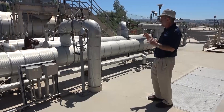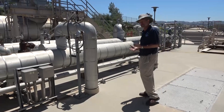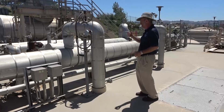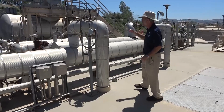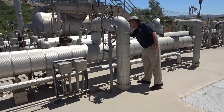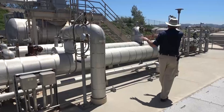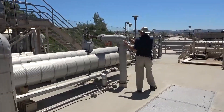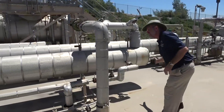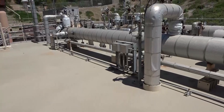When we talked about the turbine we talked about extraction steam. The extraction steam comes in from the turbine, drawn off at the appropriate pressures, and this is the extraction steam inlet to this particular feed water heater. The extraction steam moves across this way, and when it gets to the end it makes a u-turn and moves along the bottom half of the feed water heater as it moves back towards the entrance.